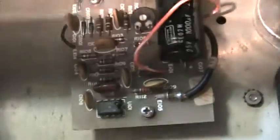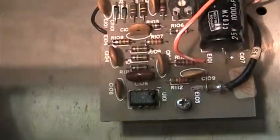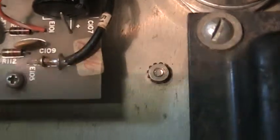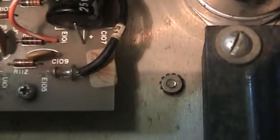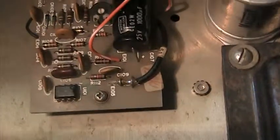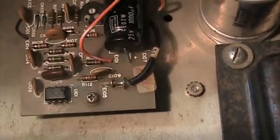On this compressor board you really only have four wires: the red for power, the black for ground to power up the compressor board, and then you have two small coaxial-type cables coming in. One is marked number 51 and the other one up here is 53. One of these is coming from the microphone jack into this board and the other one goes out of the board into the regular amplification of the radio.